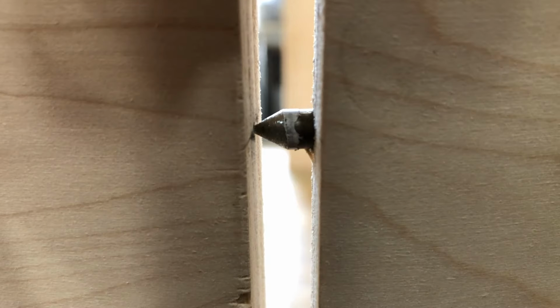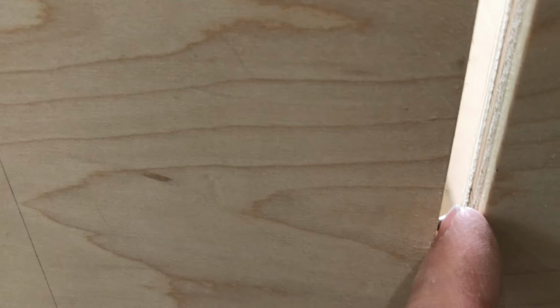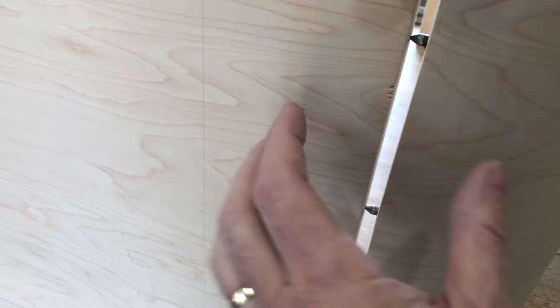And what I have in here are little centering pins. It's a 1/4-inch metal dowel that goes into this side and is sharpened to a point. So I've got 4 of them, one in each of the 4 holes, down in there. With the pieces squished together like this, I can simply tap on the top end of it and push them in a little bit farther.